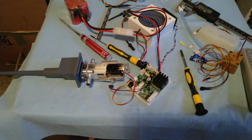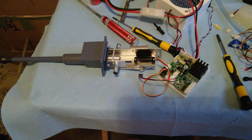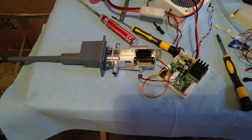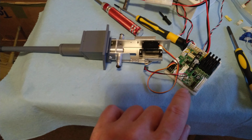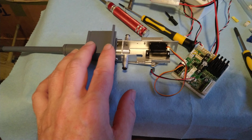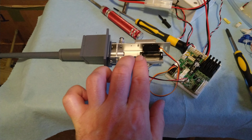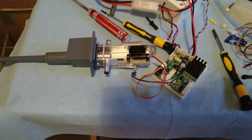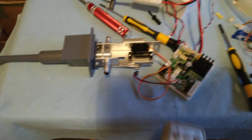The only other problem we had with the TK40 board was it was all set up by Stian for my Matilda, and it all worked perfectly. But what I found was when I plugged the servo into the servo port and switched it all on, the gun actually recoiled back to the rearwards position and stayed there. So you have to change the settings on the TK board to work with this, or I did at least.